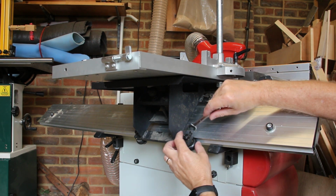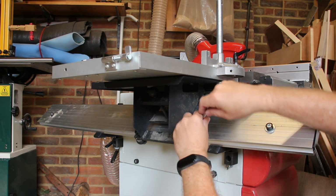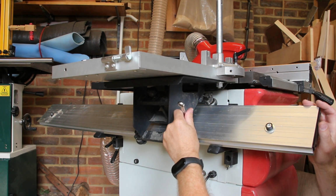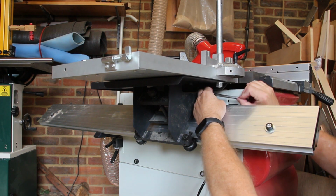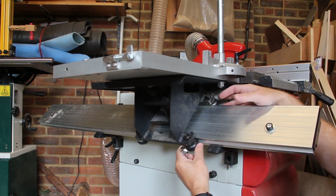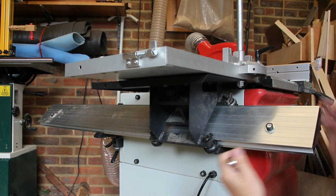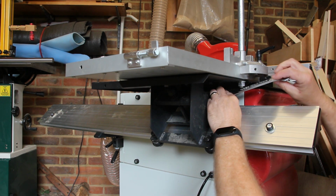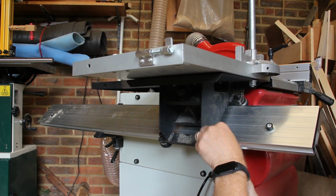And then tighten these, just that same 1/4 of a turn or 1/8 of a turn. So what I tend to do is try and move these wheels, and if they slip on the rail, then it needs readjusting. Otherwise you have play on the rail, and we don't want that.